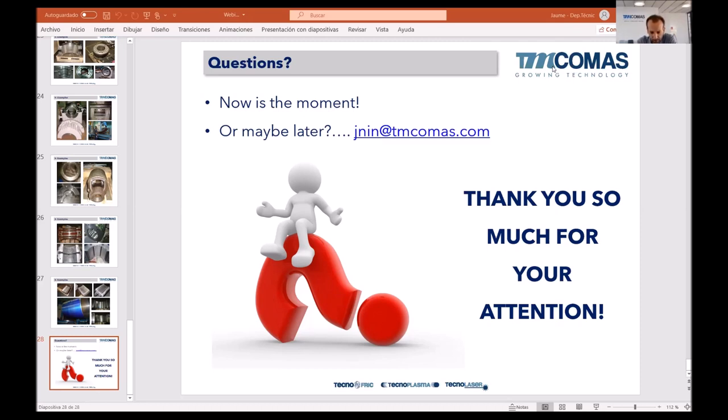Vicente is asking me, hi, what are the main criteria parameters for Babbitt grade choice? That's a good point. What we usually do here is reverse engineering. For new bearings, it's clear that we have to have a drawing. The drawing can come from the customers, and most of the time in the drawing there is some information about the Babbitt grade. If not, we ask for a sample, and we have internal capabilities for inspecting materials with spark spectroscopy, so we can have an exact idea of what the bearing alloy has to be that is recast or re-welded on the new bearing. So even if it's a repair or a manufacture of a new one, we can analyze the grade of the alloy.